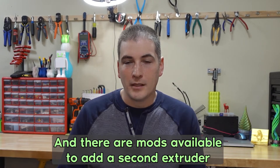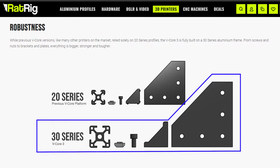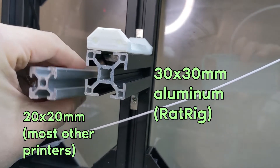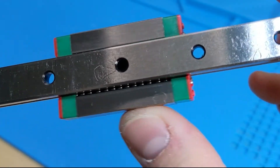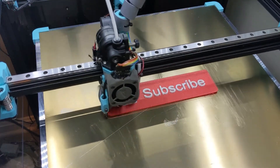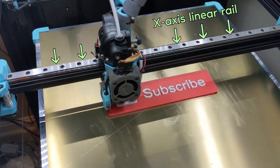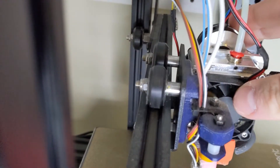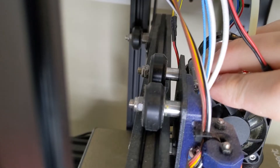The V-Core 3 is marketed as the no-compromises 3D printer option. It has all the bells and whistles that you could ever want from a single extruder 3D printer, and even the standard features are just implemented extremely well. All of RatRig's printers use 30x30 aluminum extrusion instead of the normal 20x20 that's used in more budget printers — a frame made of 30x30 aluminum extrusion is just going to be way more sturdy, rigid, and handle way more forces and vibration. RatRig printers also use linear rails for all axes of motion, used on industrial machinery and now in higher-end 3D printers. They can handle high speeds and high accelerations and really don't wear out like the V-wheels typically used on budget 3D printers.